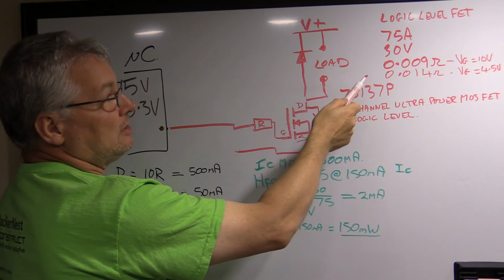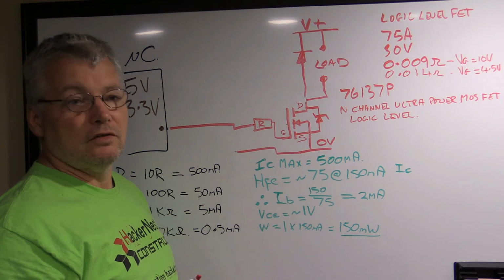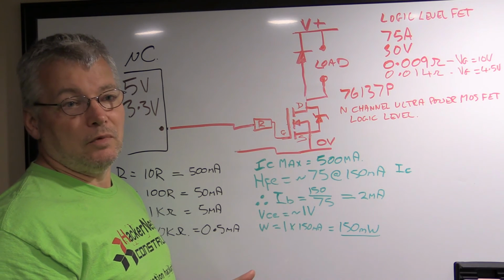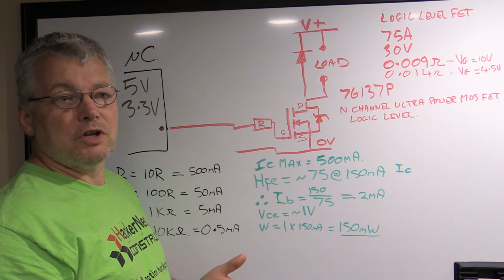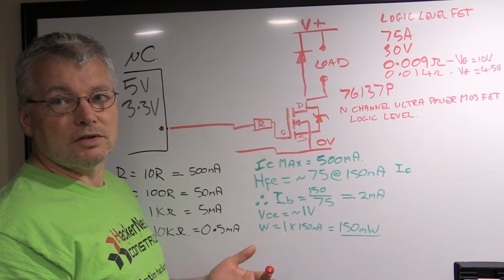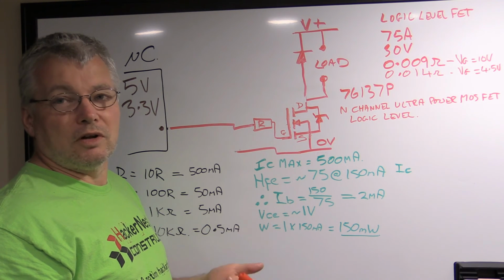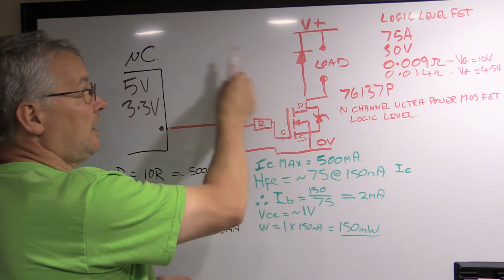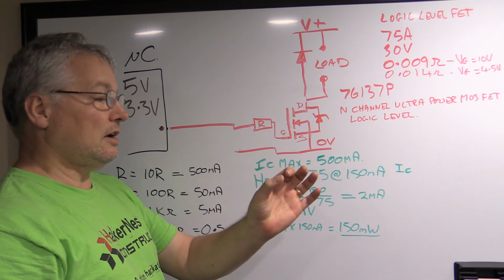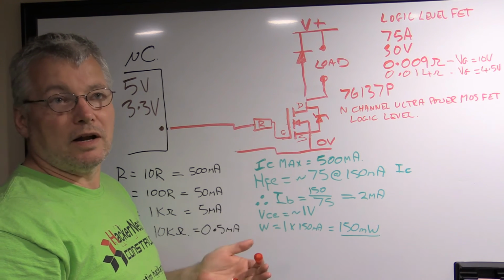And as you've seen, at low voltages, say you've got some 24 volt LED light strips for the kitchen or for a living room, and you've got a lot of them, you can easily get up into tens of amps of current that you want to switch. Now because you're isolated supply and everything else, you don't necessarily need to isolate that from the controller that's doing it, but you certainly need to have a transistor that is capable of controlling that high current. The previous circuit I had here with a regular transistor, you'd have to go to a power transistor in a large can, say like a 2N3055, and you'd have to have a heatsink on it because it's going to be dissipating quite a bit of heat.